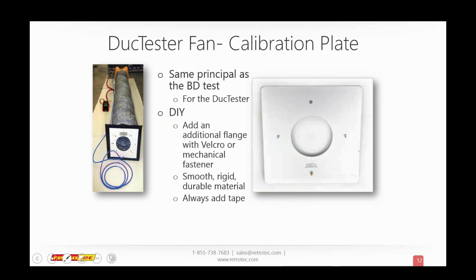You can also pick that from channel B. And it starts off with pascals and CFM, and then a flow area, CFM per 100 square feet. And on the next page, if you go to the bottom right-hand corner and select the dots, there's a whole other laundry list of additional options for you. In the very top, it actually has your leakage per square foot or square inches that don't have any additional pressures in it. And that's the easiest way to use this method. Thanks, Jay.